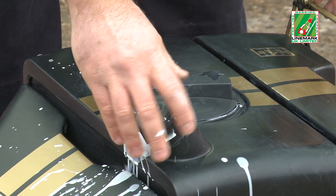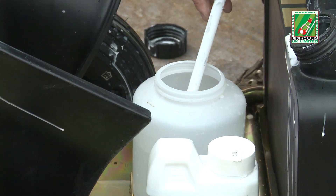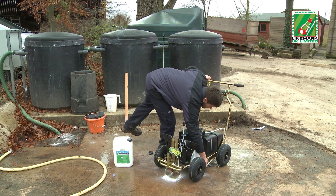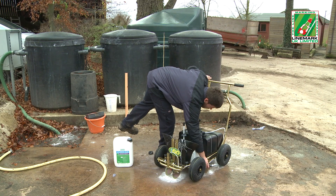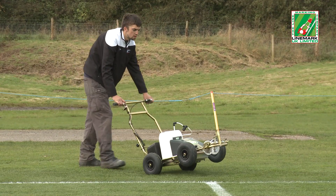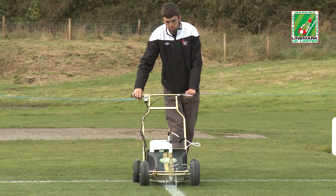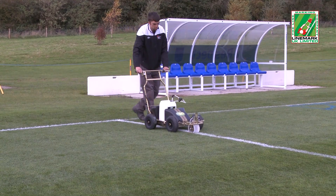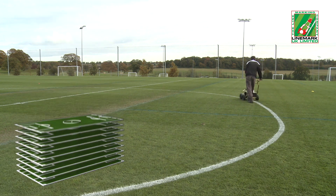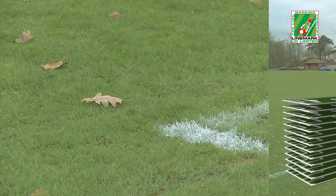Using the iGo machine for comparative purposes, the front machine cover is lifted to reveal the priming bottle into which the paint transfer tube is inserted. The procedure for making the machine ready to apply paint is the same as with the impact paint. The pump will first expel the water in the pipeline, and when paint emerges, the on-off button is pressed to stop paint flow. The striping operation can now begin. The operator continues to overmark up to nine standard-sized soccer fields when using a 2.64-gallon paint container, or up to 13 fields when using the three 1.32-gallon EcoBags.